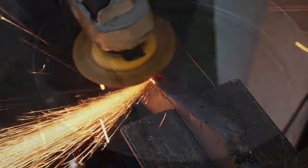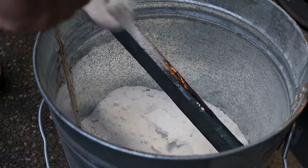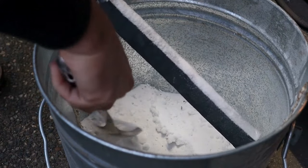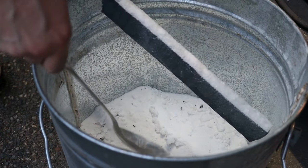After about four heats I like to grind off the welds on the corners and sides, and also go over all of the seams to make sure the forge welds all look good. I was a little worried about one side of the billet. I couldn't see any delaminations, but I could see the seams where the bars were joined, so I decided to add some flux and give it a couple more forge welding heats.